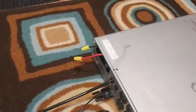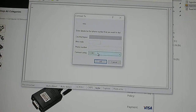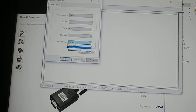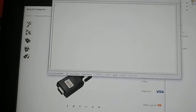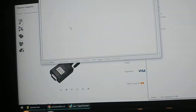I've got the UPS on the floor now — battery is not connected but it's still reading. HyperTerminal is open. Select COM7 (your converter's port), set flow control to none, leave everything else as-is, and hit OK. It now says connected.